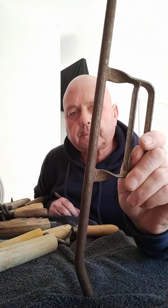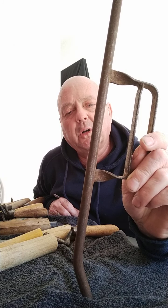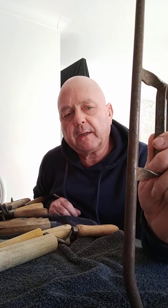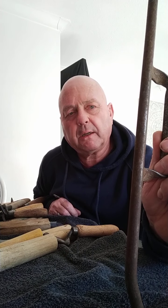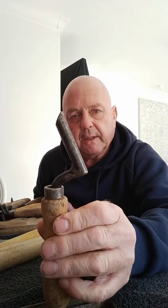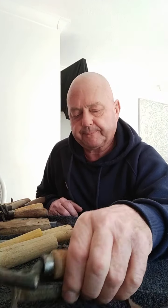Sled runner. Any Aussie bricklayers here will know what that is. Used quite a lot out in Australia. Does a lovely joint on a square brick. You do know how to use it. When I get out on site again, I'll get a chance to use it. I'll show you. That's for the bed joints, and I use that. It's the same diameter. Use that for the perps.